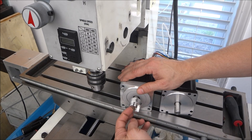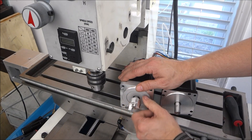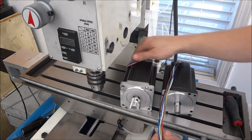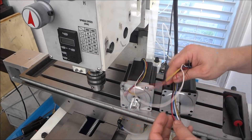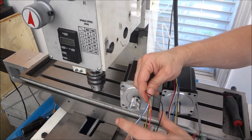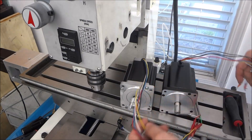Those casting differences don't matter too much - the main thing is does it work. This shaft is a D-shaft with actually two flats on it, one here and one here, whereas the other one is round. That may present a problem, but I don't think it will. The wiring looked a little smaller to me on this JMC model, and after examining it closer I can see the LeadShine motor uses 20 gauge wire while the JMC appears to use 22 gauge.